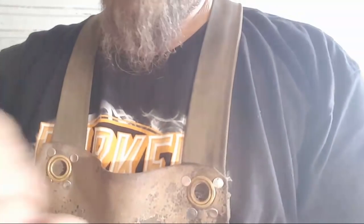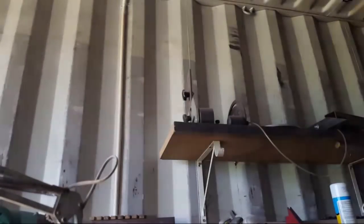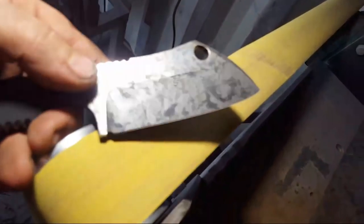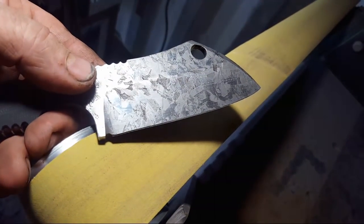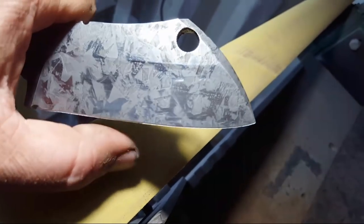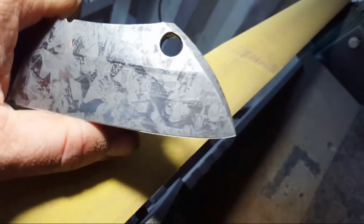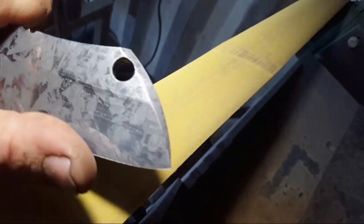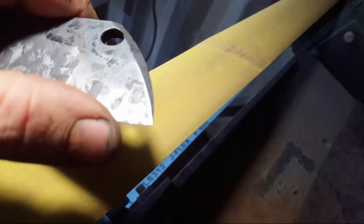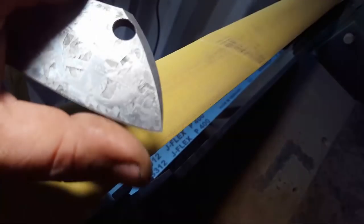And this is when you know that you actually are sharpening. Right, and that blade is already sharpened, so there's no need for us to do any further. Right, so if I look down there, can I see it? Yeah, there you can. You see that little sharp edge? This little burr, and if I touch it, I'm actually wiping that burr away. And then I'm wiping the burr back. So what you're doing is you just want to do those 2 passes, and there you go, and you will be as sharp as Bob, right?